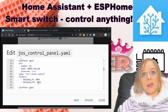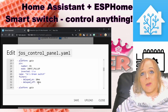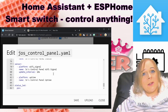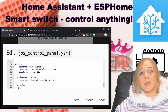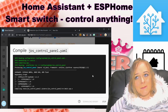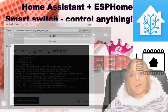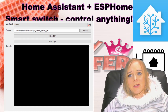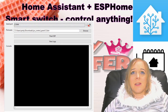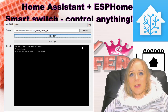The filters delayed-on and delayed-off just debounce the switch, and there's one of those for each of the switches in the case. I've also added my standard Wi-Fi signal sensor and the uptime sensor — I always include these. The next thing to do in Home Assistant is to compile the sketch, and when that's done we can choose to download the binary. We can then plug the control panel into the PC, bring up the ESPHome flasher, select the COM port and the firmware we've just downloaded, and press flash ESP.